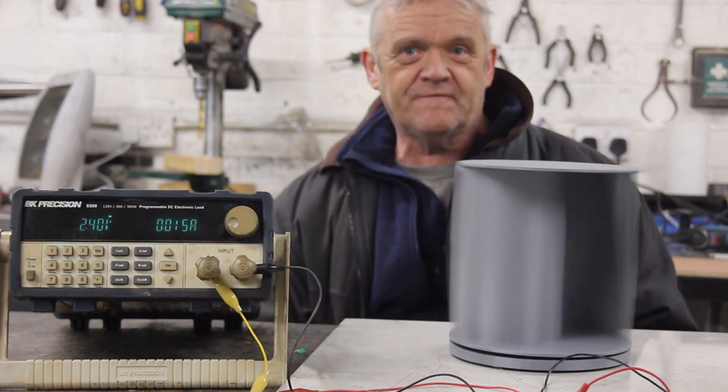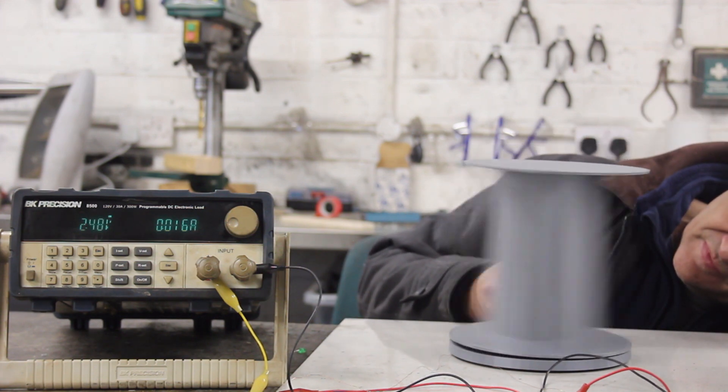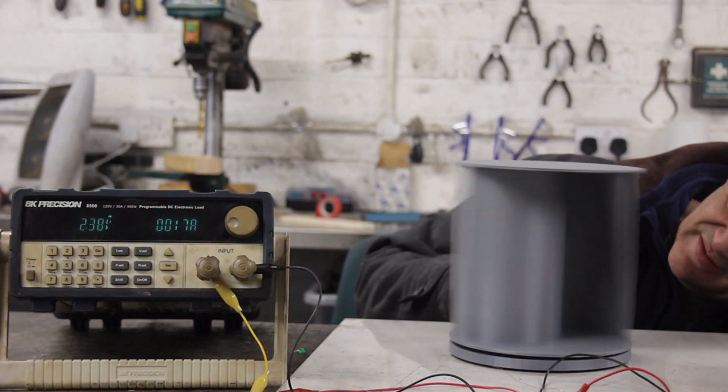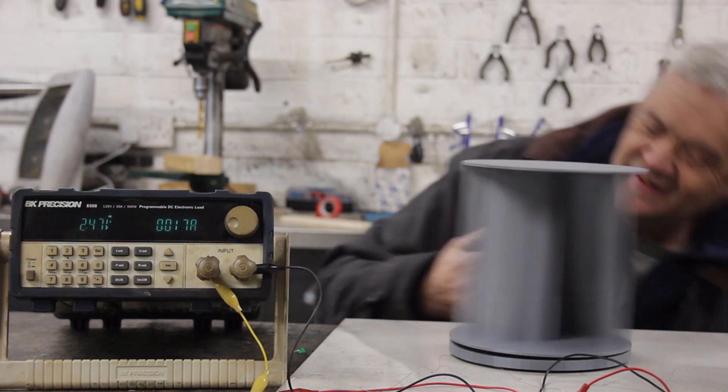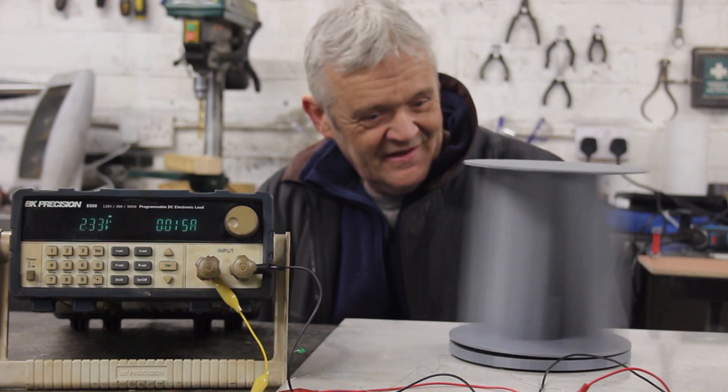I'm reading a couple of volts - 12 to 14 milliamps - and the wind speed is 1.7 meters per second. That's absolutely awesome. For me that was a knock-it-out-of-the-park success, showing that generation by speed at the rim really works against a load and gives a really good result. The design principles of keep it simple are really what you need to head for - you want something that's going to be produced.